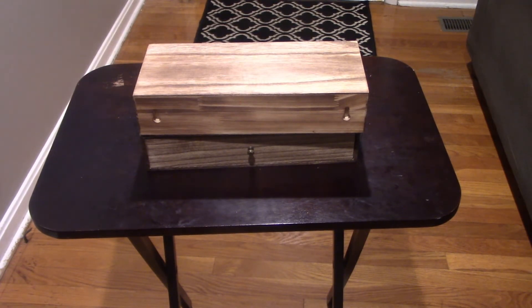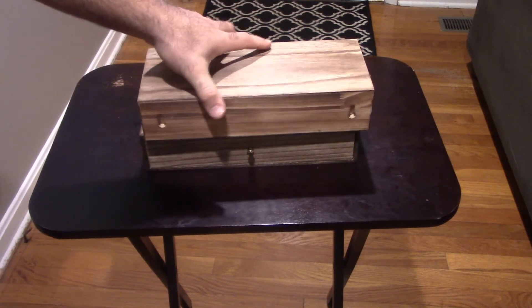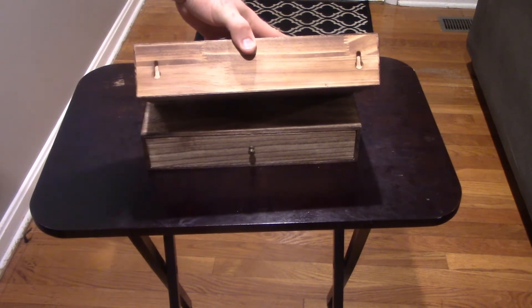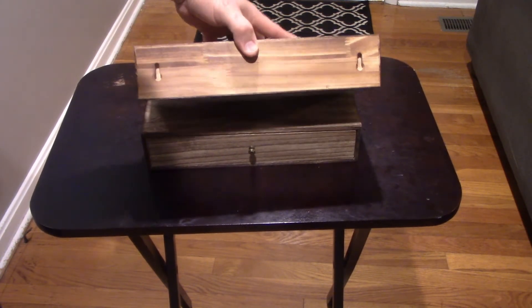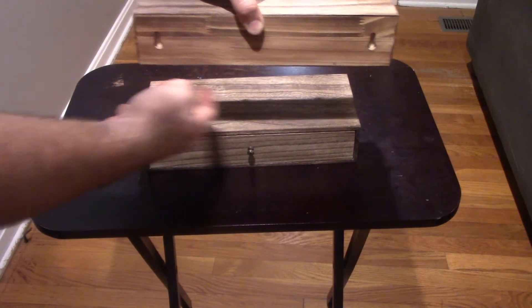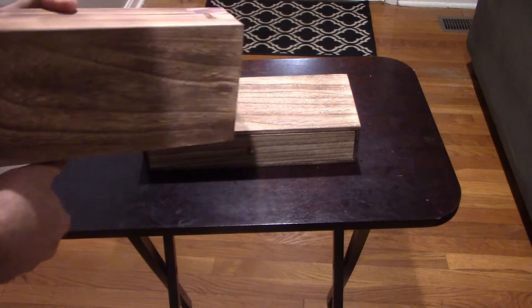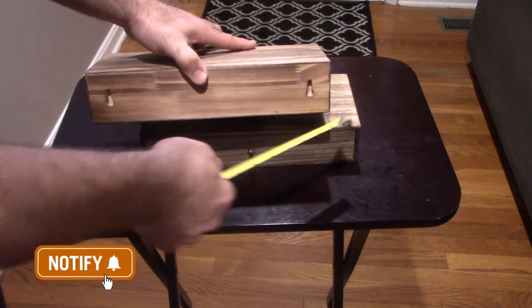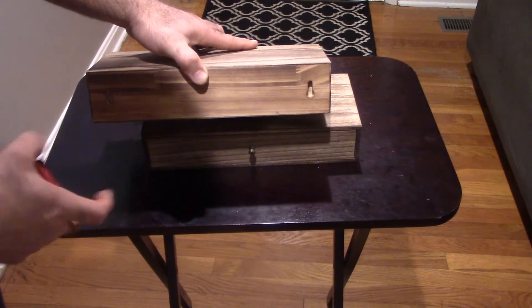So we've got to figure out where we want our screws to be on the wall. The first thing you're going to want to do is, if it comes with instructions, look at the instructions. On mine, the only measurement it would give you was the spacing between the two — they're exactly 10 inches apart, center to center. So what I did was have my wife set this up on the wall, put a mark on the very bottom and then on one of the two edges. You know they're 10 inches apart, but you don't know how far it is from the bottom or from the side. If you have exactly where you want to set it, put a mark on the bottom and a mark on the side, then you can measure up from the bottom to find your center, and then measure over from the side to find your center.